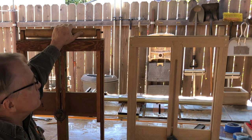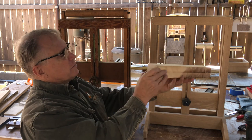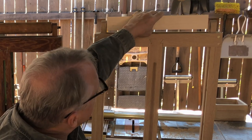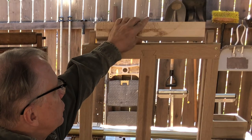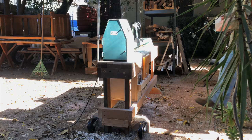I think I'm going to use maple. I've glued two pieces of hard maple together and I have a two-inch square. I've cut it to fit my space and I'm going to take it to the lathe and round it off. If you don't have a lathe, you still have options - you could use handrail, or a dowel of the largest size you could find, anything close to two inches. Or you could cut and trim it on the table saw, one corner at a time, a little bit more until it was round, and then use some sandpaper. Remember, this is never going to be high-speed action, so things don't have to be perfect.